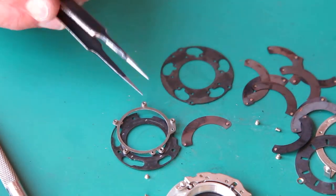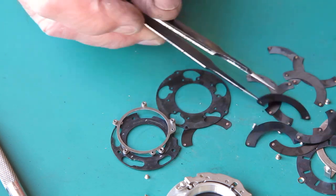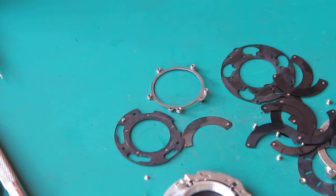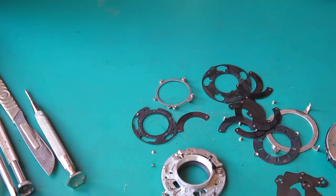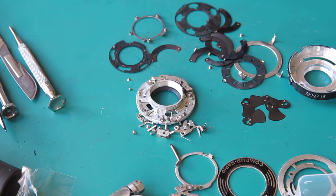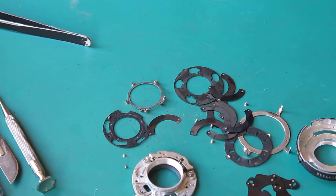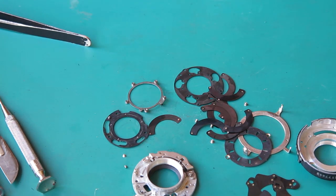If the blades are stuck together — glued with oil — and you force the settings ring, then one of two things can happen: the rivets can be actually torn off the blades, or they can just pull out of their respective slots. Or the blades can become distorted so that they no longer lie flat. A blade that no longer lies flat is fine when fully assembled, but it's very hard to get the blades correctly positioned in their respective holes in the plates if they're curved and wanting to tip out. So oily blades can create a problem. This camera would have been made in 1935 or 1936, so it's a bit older than me — still, I think it can be made into a good photo taker.